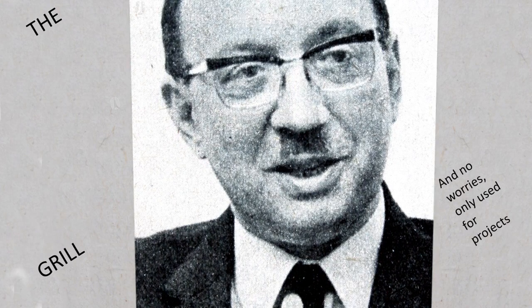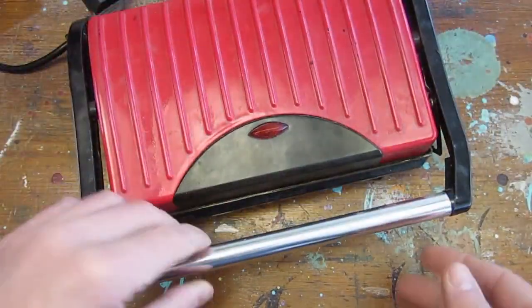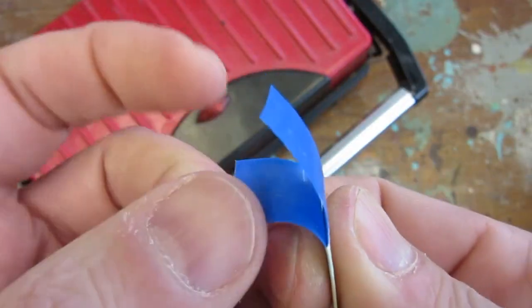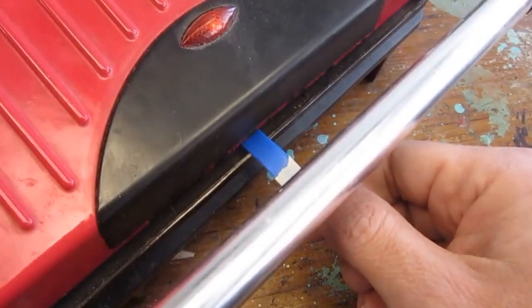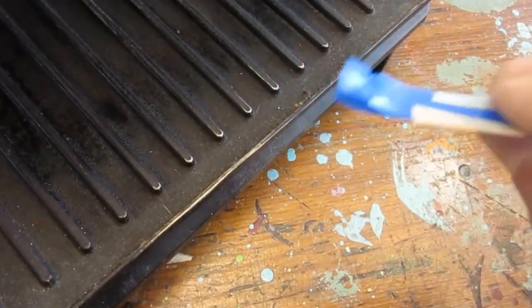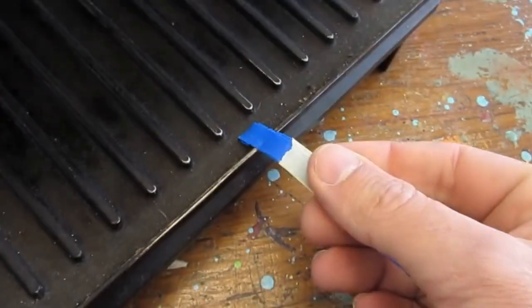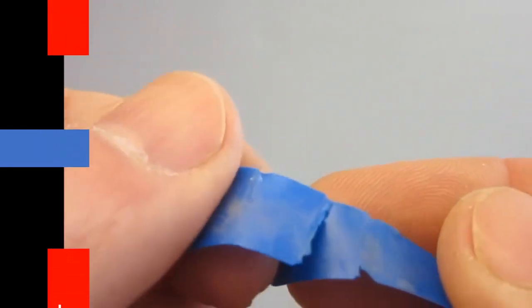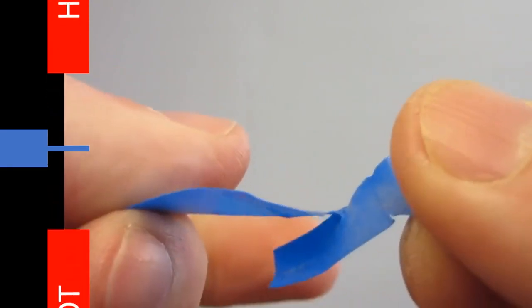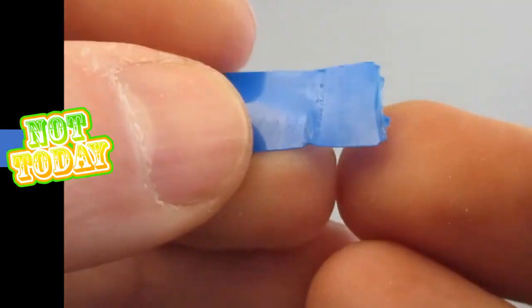To melt both sides at the same time, I'm using for the second test a small grill that I found in the trash and repaired. I'm not gonna overwork it here, and just used it as is without modifications, simply to check if it is a promising solution or not. Well, it does look like a big failure, but I believe it could still work. This would however imply bringing in some heat regulation and mounting flat custom plates that align upon closure so that the plastic parts can be perfectly pinched. But that is too much work for what I'm looking for right now, also because I do not want yet to modify the grill.